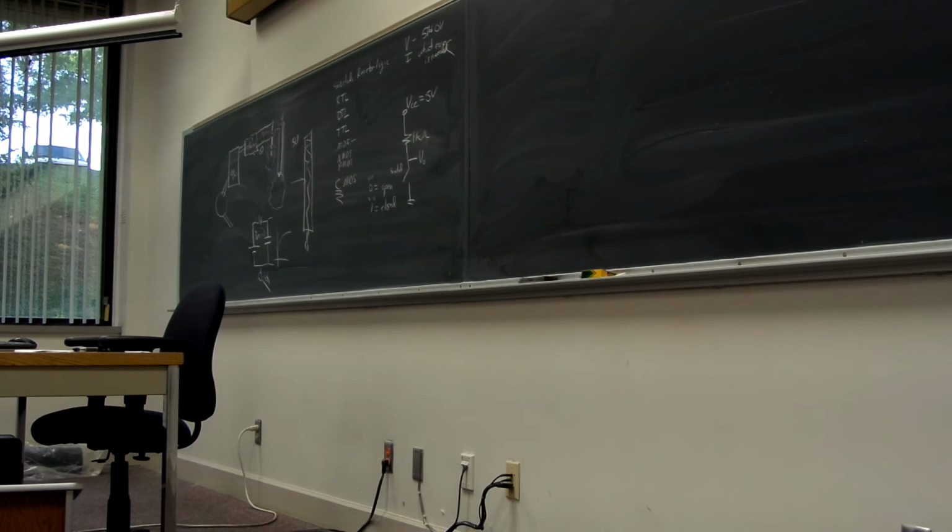First of all, in the position I have it, what's the input? 0 or 1? Two choices. What's the input? 5 volts. To the switch. Zero. Everybody okay? The switch is what? Open. Therefore, what am I putting in? Putting in a logic level 0. Yes? Nothing. Remember, 0 is an input. All right. What is coming out?